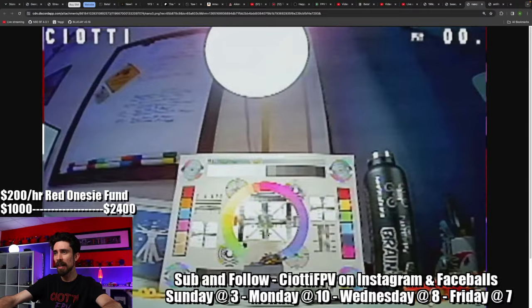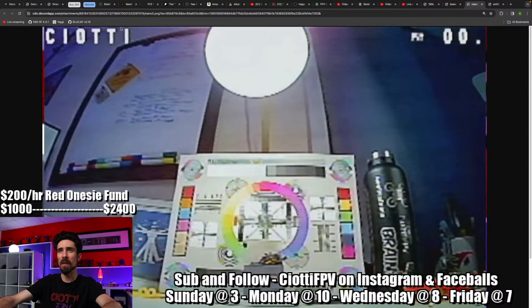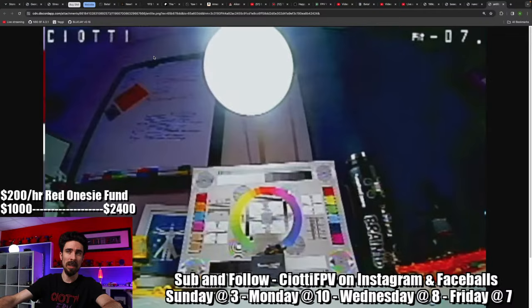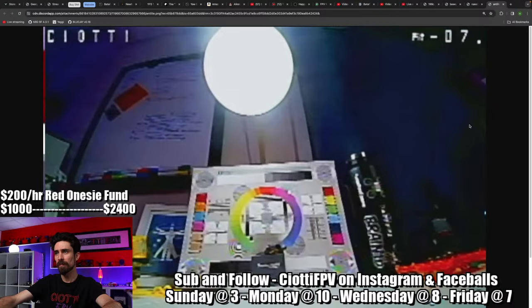The Caddx is going to be heavier, bigger lens, and you're going to have to print a special little thing to mount it in the Mobula 6 canopy. The Nano 3 is doing an arguably better job exposing everything. Like, up here in the top left corner, this is very underexposed, as we can see by the Caddx, but the Runcam really brightens it up. That's a big difference. This is a way more flyable image, in terms of if I was going to drop down into the darkness. I'm actually really surprised at how good the Caddx Ant looks, though. But Runcam Nano 3 is still the winner.